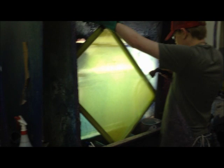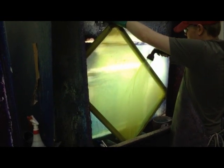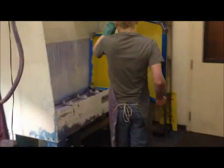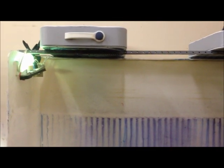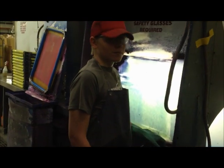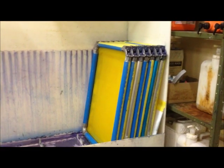Then he's going to take the garden hose at city water pressure and go through and sheet the screen to make sure he's got a clean screen — no fish eyes, no emulsion or chemical residue. If he's happy with the way it sheets off, he then takes it and puts it into an old washout sink we've converted into a drying rack. That drying rack has a couple of box fans across the top — you can throw furnace filters on top of them to keep the air clean. In our situation it allows 34 screens to dry completely, and then they go into our screen room for coating. That's how we reclaim screens at Mind's Eye Graphics. Average throughput when you're not in a hurry is about 20 to 22 screens per hour. If you put a second person on doing the ink removal, you can get up to 30 to 35 easily.